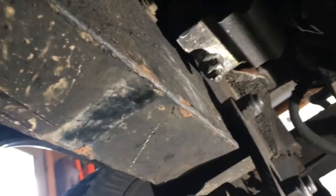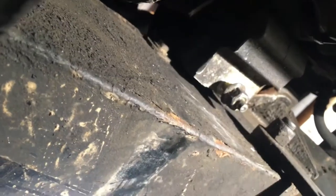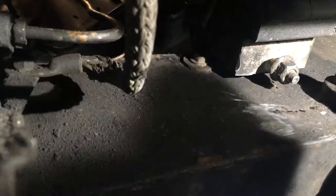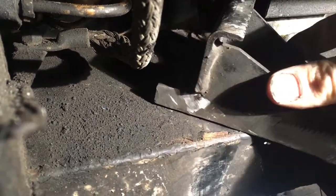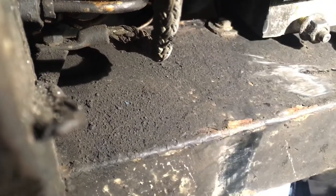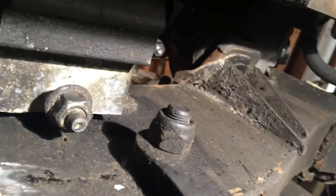Let me articulate what I was saying a little bit better — you can see now how tight everything fits. Where I talked about cutting, there's just this extra little lip on the rubber that sticks out and it was fouling on the bolts as I was trying to get this through. And we see now basically how this is in place here. If I hold up the part I've cut off of the donor Defender, you can see that just isn't going to slide up. You can see where the bolt holes are off by a good inch and you also see the conflict there. So I've got my work cut out for modifications.